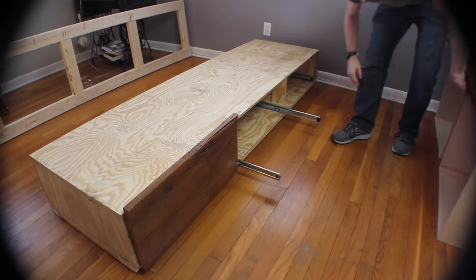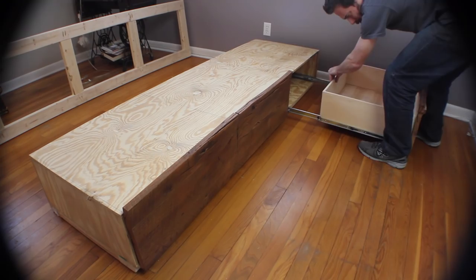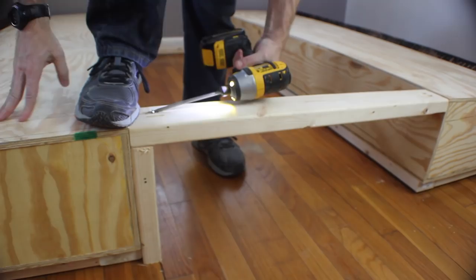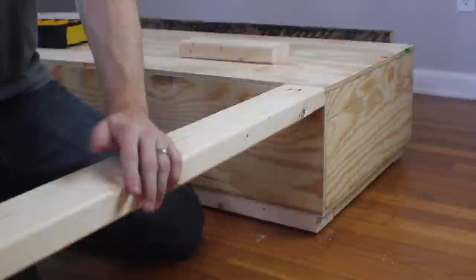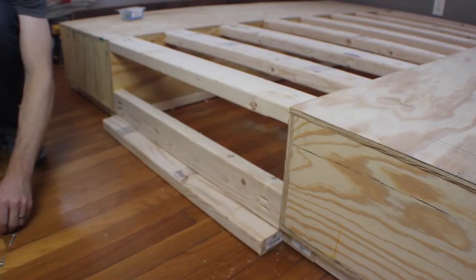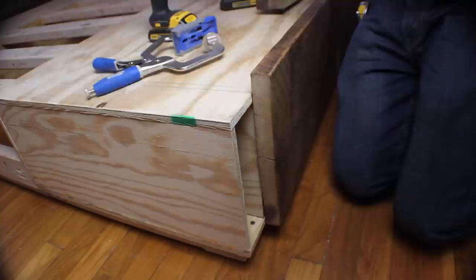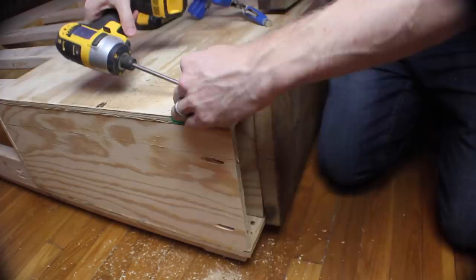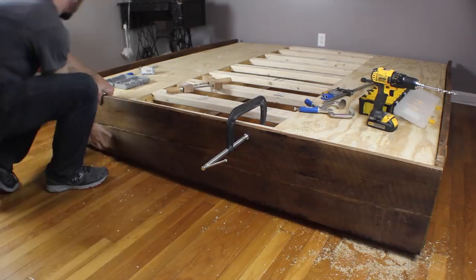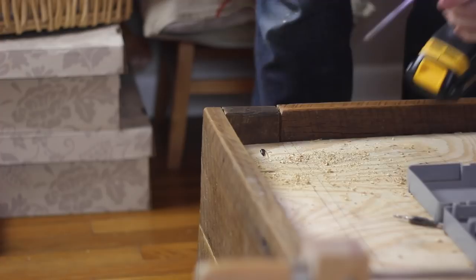Then I just added the drawers. Sometimes when you get to putting them all in, they can be a little hard to deal with, but just keep trying — you'll get them all in there and they'll line up. To attach the cabinets with the cross braces, I cut a piece of 2x4 the same height as the cabinet; this allowed me to make sure that the 2x4 and the top of the cabinet were even. I used the same process all the way down, adding all the cross braces. You could glue these in as well, but I didn't since I wasn't sure if I would need to change it later and take it apart to get it out of the bedroom. I added another 2x4 on each end of the bed. I had planned a mitered edge on the corner, but it just didn't work out — the wood was too bowed and started to crack, so I ended up just making a butt joint. I put pocket holes all along the backside, held the big piece in place, and then attached it with screws, making sure to get the tops all lined up on both ends.